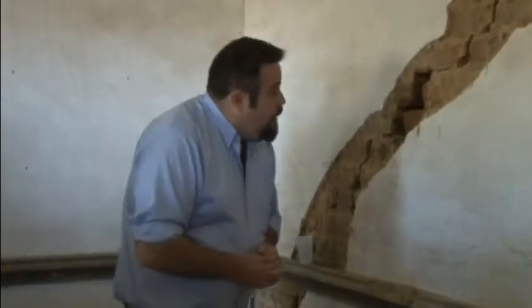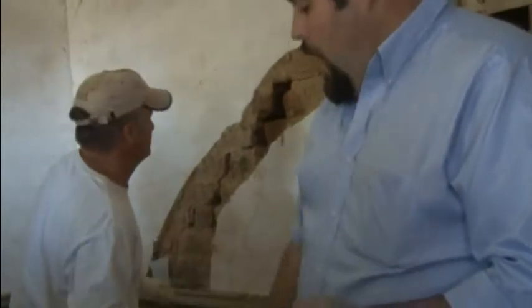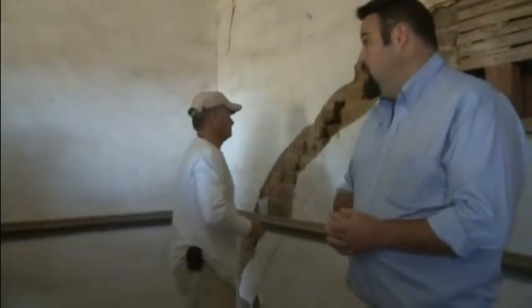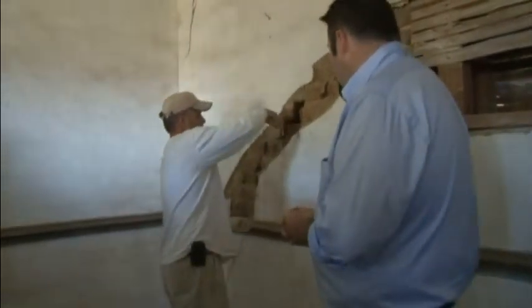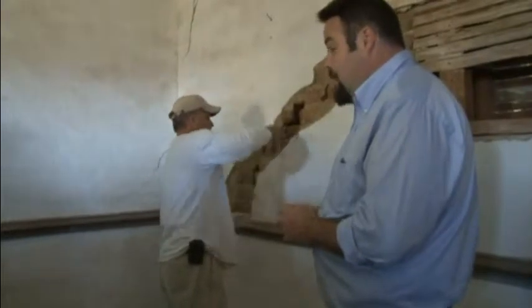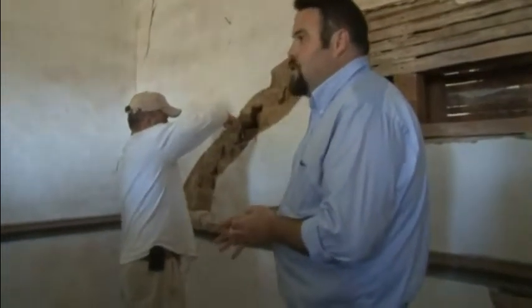What kind of drying time is on that? It doesn't actually affect the properties of the lime with the exception of viscosity — it changes the viscosity. This lime gets pretty tough after about eight hours, which is one of the nice things about hydraulic lime. With non-hydraulic limes it can stay thumbprint hard for days. With Building Lime 150 — our moderately hydraulic lime — it's going to be thumbprint hard overnight, and you'll have much faster resistance to frost as well. Casein — is that something you sell? We do have it. We do pre-blended grouts, so all you have to do is add a small amount of water.